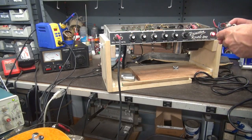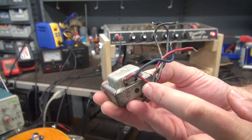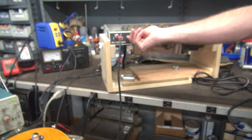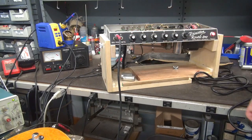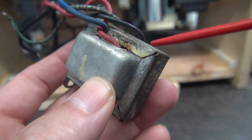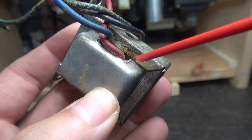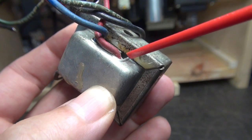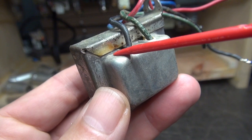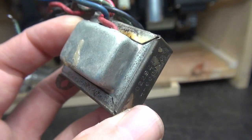Got the new transformer installed. Here is the old one — and right there you can see evidence of maybe some arcing on the primary lead going in. Looking down in here, I can see some blackness. I believe that one of the windings arced to ground — there's a carbon path. It was probably exposed to moisture in its past. There's another sign of an arc. They're only about 20 bucks a pop, but it is a shame the original fried. But that's vintage electronics — 50-plus years old.